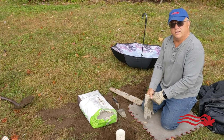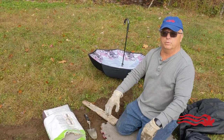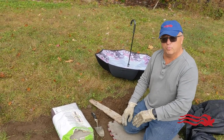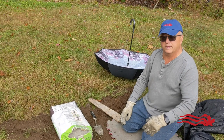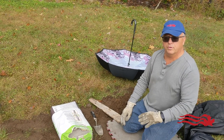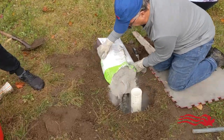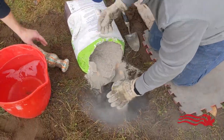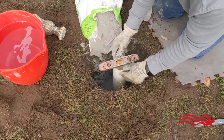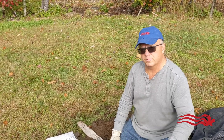Now the hole is set — wide enough, with gravel in place, and the sleeve sitting in the gravel with the bolt at the lower end. We're going to start adding the cement. As you add the water and cement, you need to mix it to a pudding-like consistency, and keep checking the level. Halfway through, you can let it harden a bit before continuing the install.